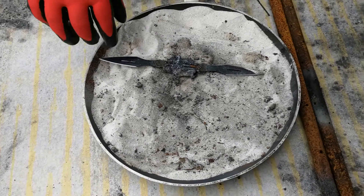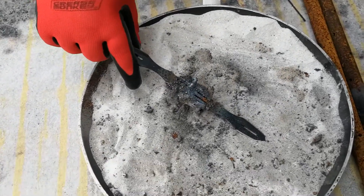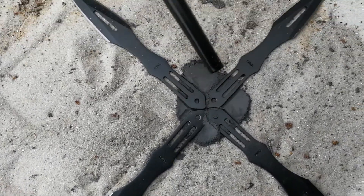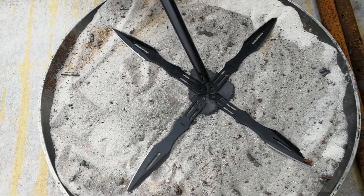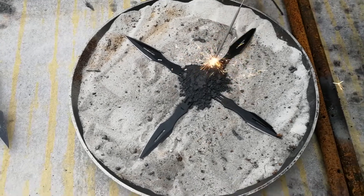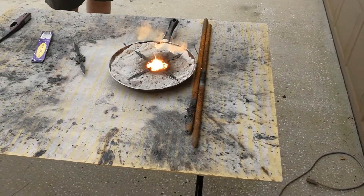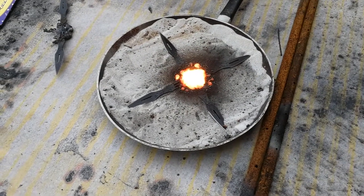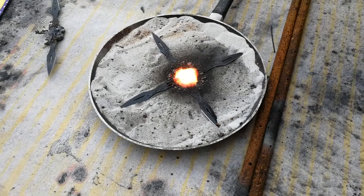Let's step this up a little bit and try to do four of these together. I'm not making any kind of usable weapon here — I'm just testing out the viability of using thermite for welding. We've got the knives laid out here. They make a pattern — they've got a 45-degree angle cut on there so they look like they're meant to fit together, though obviously they're not. We put a little divot underneath with some thermite in it, and now we're putting some thermite on top and lighting it. That looked like it burned well. Hopefully the thermite underneath has all burned and isn't waiting to ignite when we reach for it. We'll let it cool down and come back.